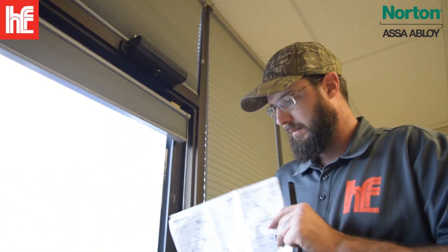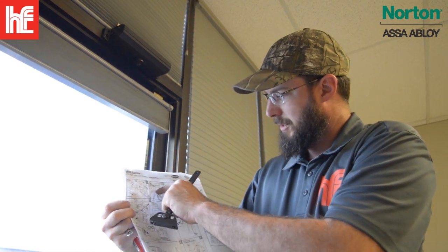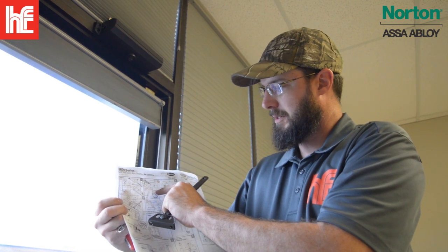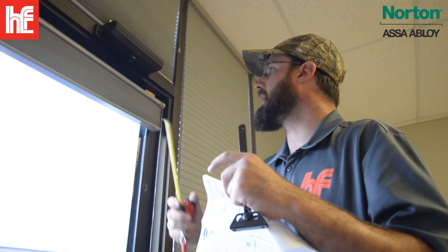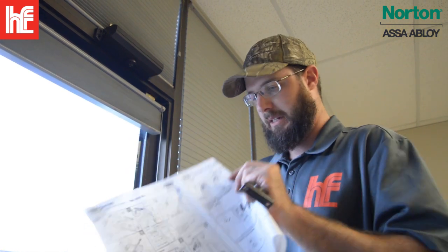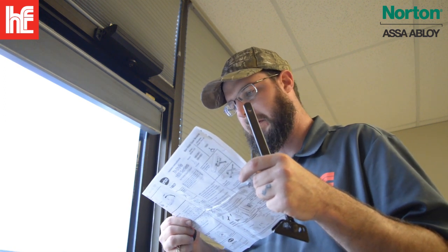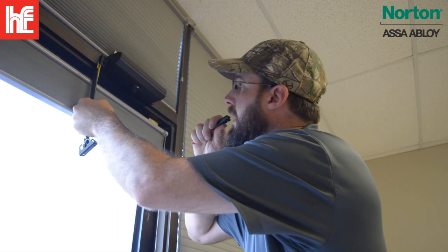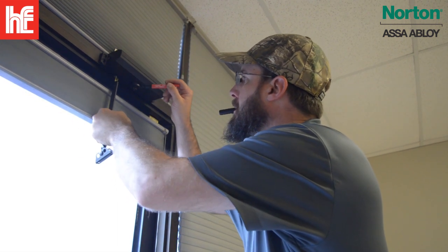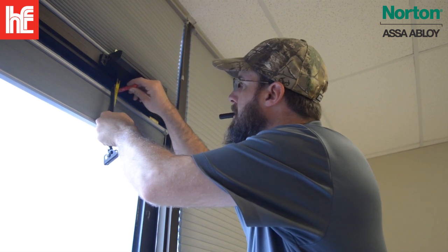Okay. So now we're gonna get the down measurement from the bolt, from where the top screws are down to where the bottom screws on the arm are gonna be, needs to be an inch and a half difference. So we need to be an inch and a half down from the bottom of the bolts. And 6 inches over, that's where that 6-on-6 is gonna come in. So to be an inch and a half, we need to be right there